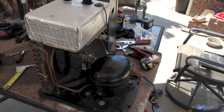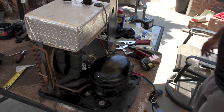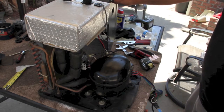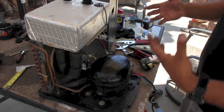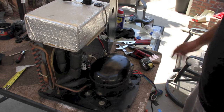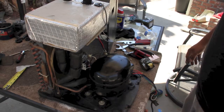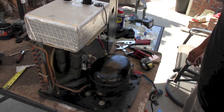All right guys, I just wired the new unit to the existing temperature control — I didn't record it because I wasn't sure something would go wrong, but I got it right. I decided to go this route because I don't want the fan running when the chiller's not running — just a waste of energy. So we're back at 100%, running. I'm using the existing wire harness to run the new motor. I'm very pleased — I did a maintenance cleanup too; it was really dirty in there and I should clean it more often. That could have been part of why the old motor went out.